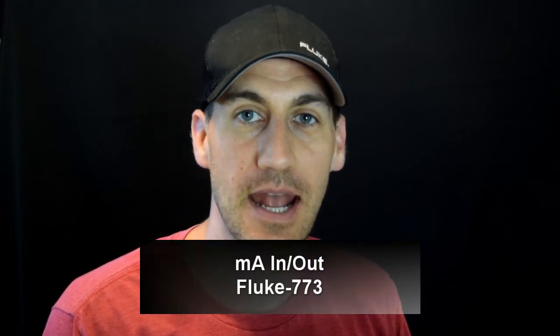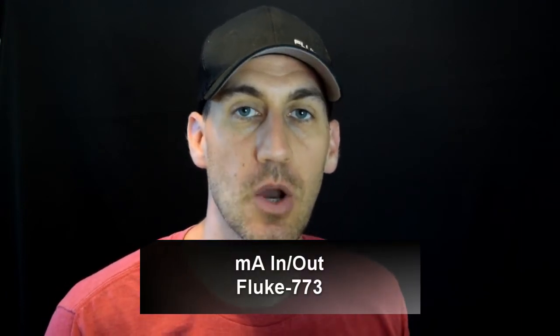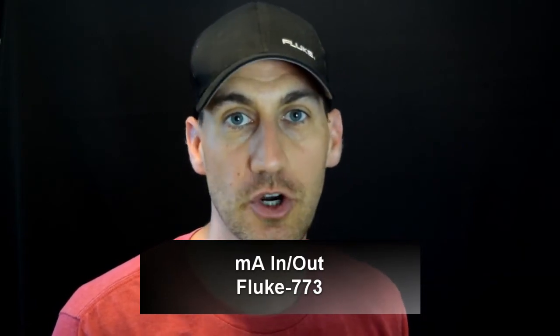What we're going to talk about is milliamp in-out. This is a little different than milliamp scale — with milliamp in-out you are choosing what you're going to source out of it and you're just measuring with the clamp. Versus milliamp scale, where what you measure with the clamp goes out the output. With milliamp in-out, you are dictating what is going to be output and the clamp is just passively measuring. This is useful if you have a repeater or transmitter with a milliamp signal in and a milliamp signal out, and you want to verify that 12 milliamps in gives you 12 milliamps out.